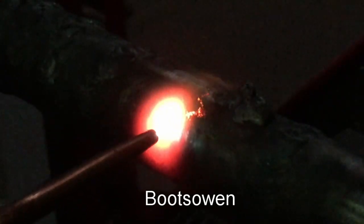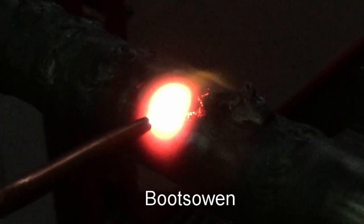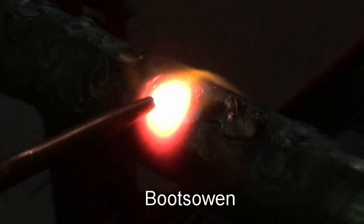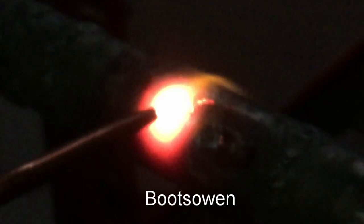This is the reason I wanted to get back into oxy-acetylene welding from arc, which is what I was using before. This is thin-wall bicycle tube — I don't know what it would be, half a mil, something like that. You can weld this with arc but it's a bit of a nightmare, and arc's smoky and dirty and noisy.